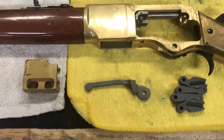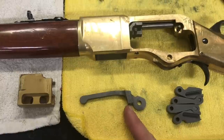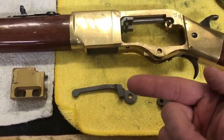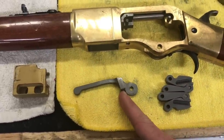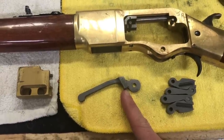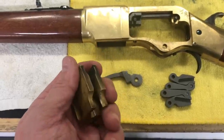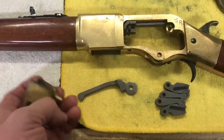If you end up over-timing the kit, it's not the end of the world. It just means you've taken too much material from the underside of the lifter arm, which means the carrier is not going to rise to its top position for the bolt to push the bullet into the chamber. The lifter arms can actually be repaired — a little TIG weld right here — or if it's been whittled down to a nub, you can always buy a brand new lifter arm from us. If you want to keep the stock carrier that comes with your gun, you will have to modify the stock brass carrier, and there is a video on the website that shows you how to do that.